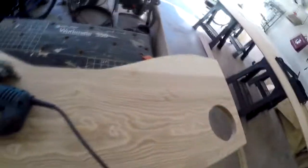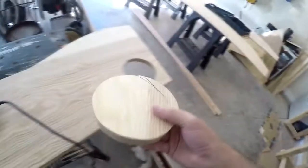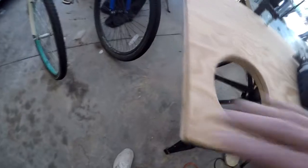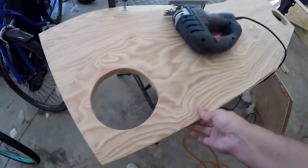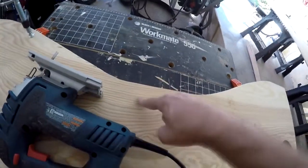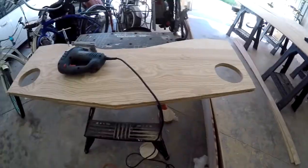This morning I cut the holes out with the jigsaw — I hadn't done that before, it was really difficult. So that part's done. I curved that part there. Now I'm just going to fair this out — there's a little gap here. I've got to trim all this down, sand it up, then do my final fairing. The transom is actually two half-inch pieces, so that's a full inch. The motor is going to sit right there and the brackets will go there.